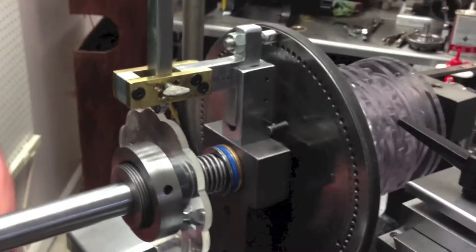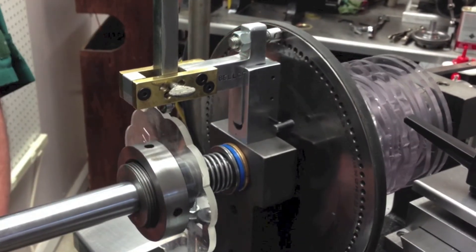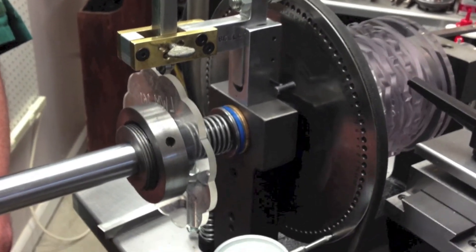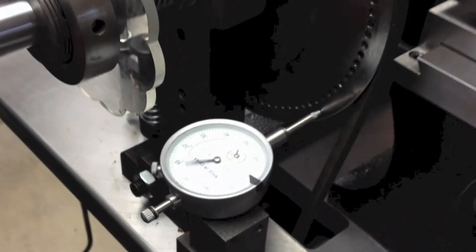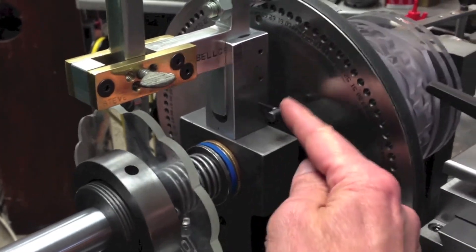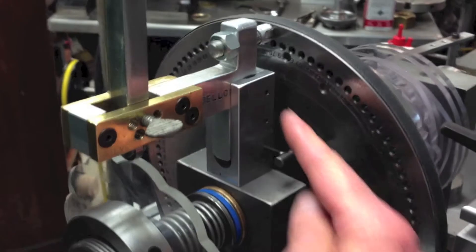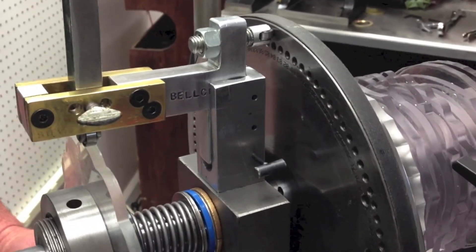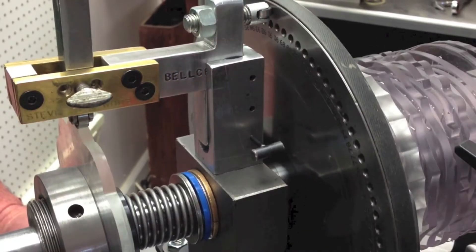So let's take a look at that. Right now this particular rosette has a one-eighth of an inch pump going on it. Of course if you decided you wanted less, all you have to do is pull this pin and pick a different hinge point — by changing where you're pinned in, you change the amount of amplitude you get in the pumping direction.